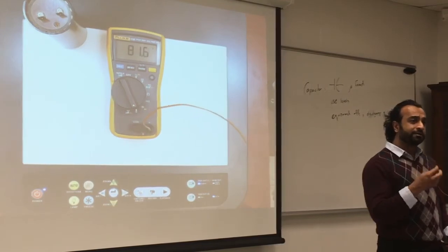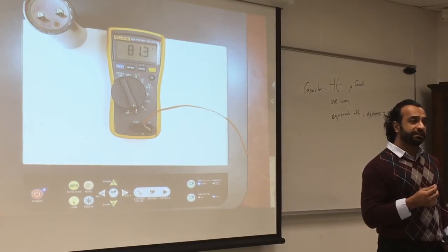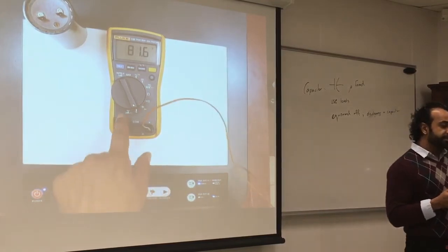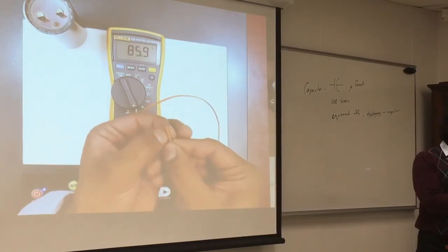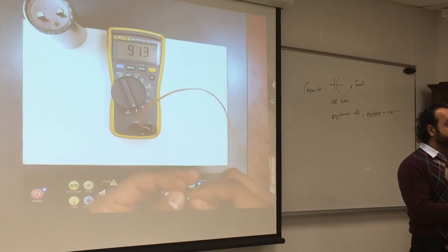Remember when we talked about electricity? Remember one of the means to generate electricity is heating dissimilar metals? And we said that is the thermal way to generate electricity. So this tip here is generating a small voltage. It's two metals, one of them is copper, one of them is nickel. At the tip, when it's heated, it's going to generate a small amount of voltage.